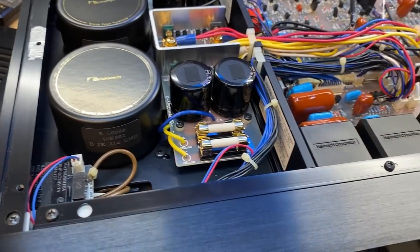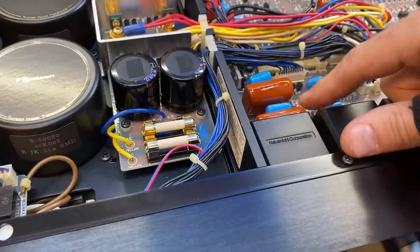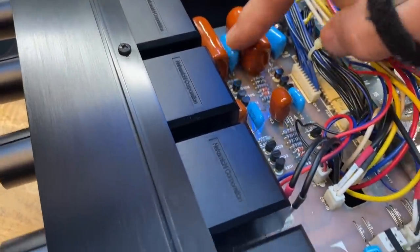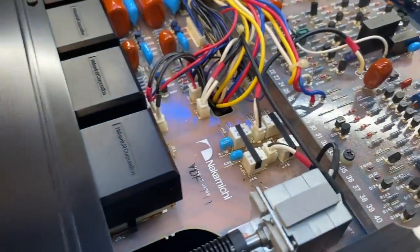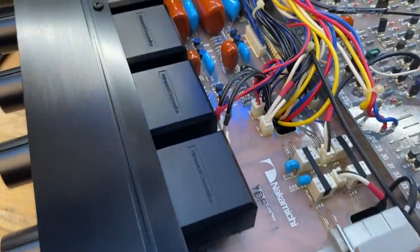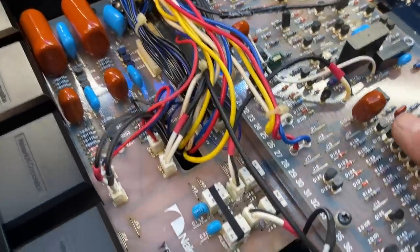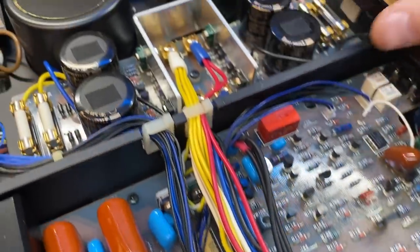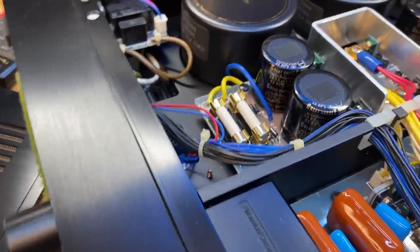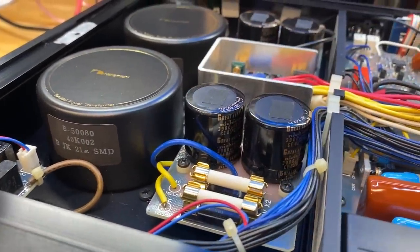The other thing that's notable is the lack of electrolytic capacitors — or at least the fact that they use film capacitors throughout the signal path. These are the film caps right here. There are very few electrolytics present. On these boards for the signal path and tone control, I don't see a single electrolytic capacitor — they are all film capacitors. The only electrolytics appear in the power supply stage, and they're super high quality Nichicon caps made for the audio world, so these are not likely to fail in our lifetime.